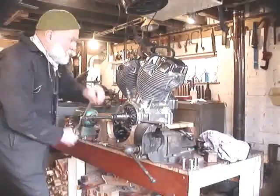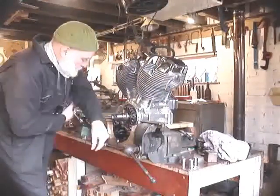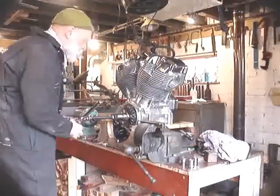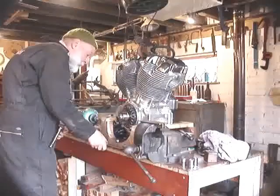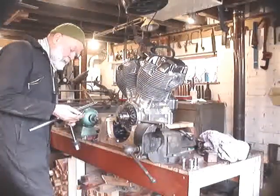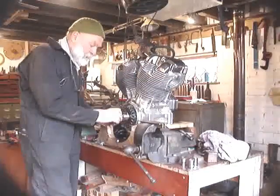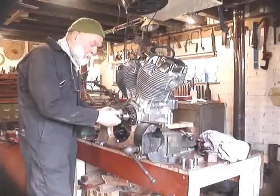I'll do this without the engine turning over only because I've still got the spark plugs in. It's starting to turn over. I'll probably want to get on a bit deeper than that. Actually, that is about as close as I need it to be. I'm now going to pull that off again in the knowledge that when we come to do the final assembly, that last 5mm will pull on really tight.